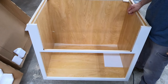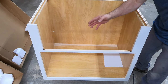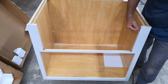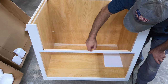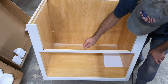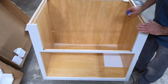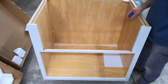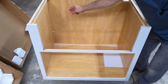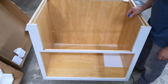It'll be supported. Once I get a chance to check this, if everything's proper, we'll put a little sealer on it. When I cut this, I didn't cut to the inside of the line — I cut right on the line and even over it a little bit. So the sink should be even with this or down a touch, because that allows us to shim up. We'll also attach this from the backside to the structure we're going to make — probably inch and a half poplar or something. I'll see what I've got around.